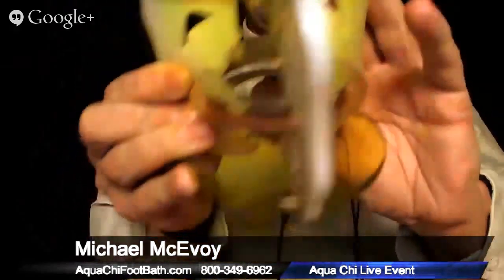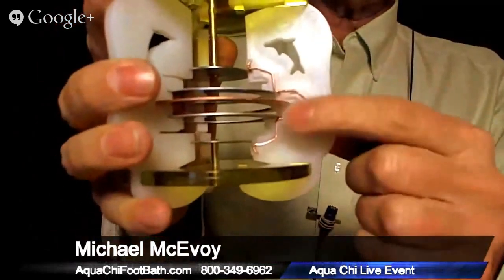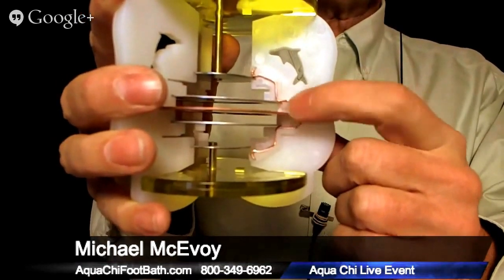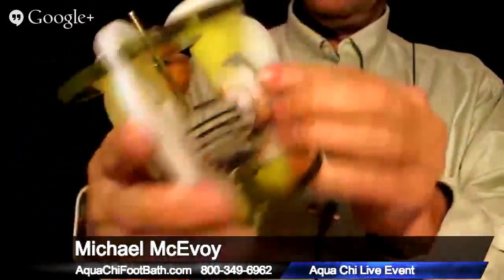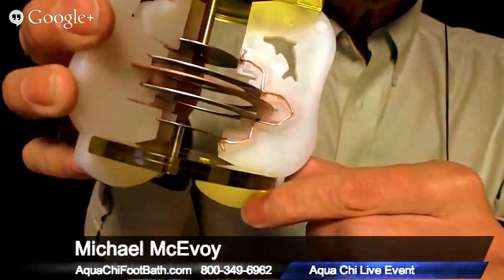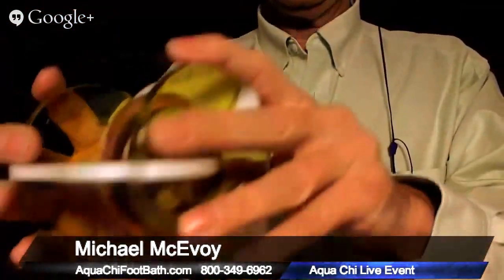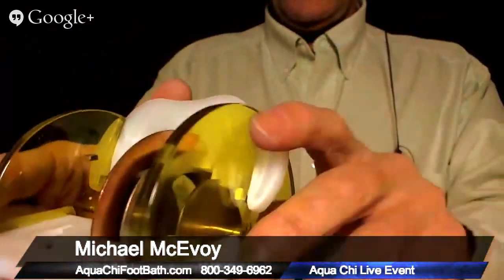Okay, the other thing is, and this is the critical thing and why a lot of people don't get this right, is that unless these four points where the rings touch this copper strip are touching the module, your performance won't be right. So we want to make sure that everything is sitting in there nicely. Now I can see that the top one looks pretty good, but the bottom piece, this one, that ring is not touching the strip. So what I'm going to do is, and it's partly because this leg's not all the way in yet, I want to make sure it's lined up.